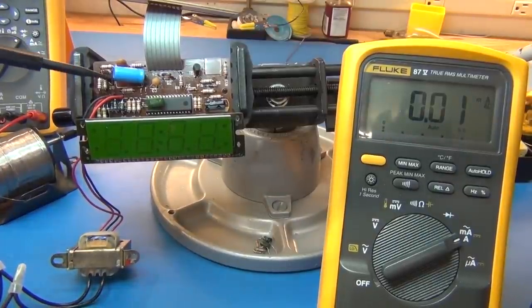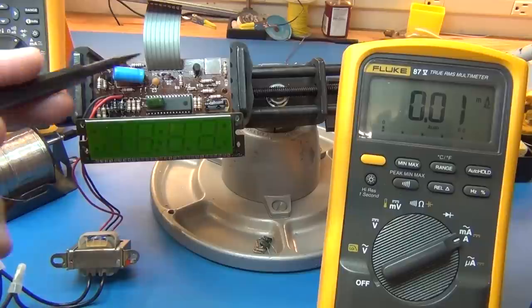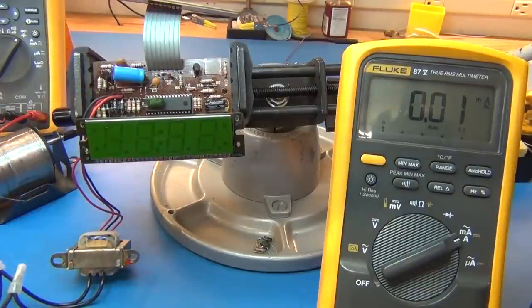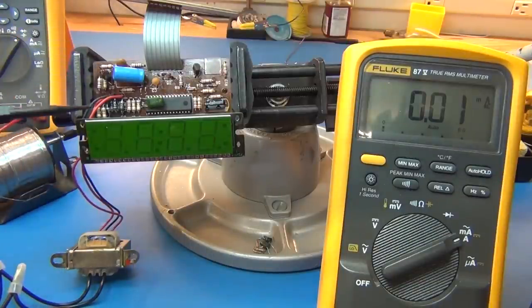Well, I dug through my pile and I found the transistor that had the closest characteristics. Tried to go a little bit over if possible so that it's actually a better performing transistor. For this, but it's just driving a speaker. It's going to drive a little 8-ohm buzzer, so it doesn't really matter that much unless something goes wrong or starts drawing current down someplace.